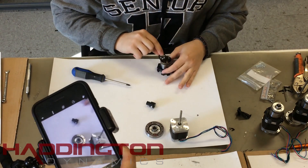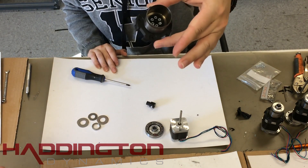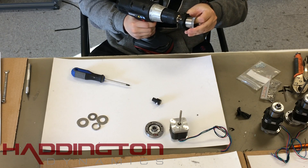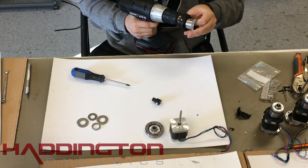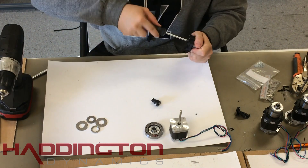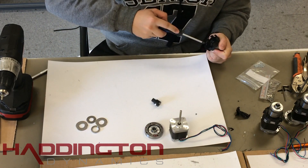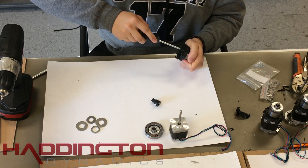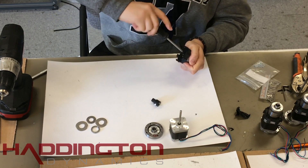Take your flex spline cap and place it with the nuts facing up while aligning it with the holes. Now tighten the bolts into the flex spline cap. Be sure to distribute pressure evenly by tightening bolts opposite to each other rather than moving from one to the next. A screwdriver should be used for the final adjustments to make sure each bolt is evenly tightened. The bolt will go below the first few layers of the hole when it's fully tightened.